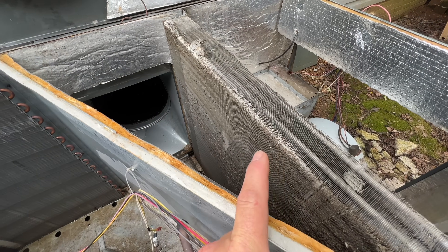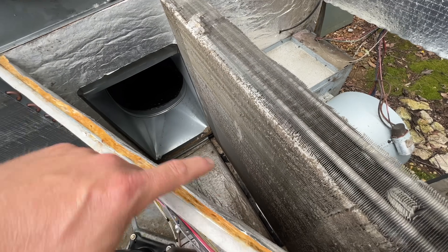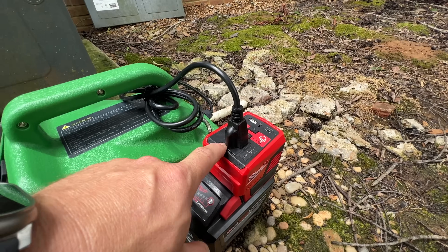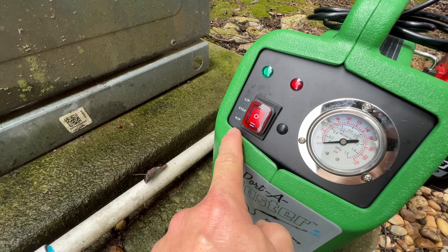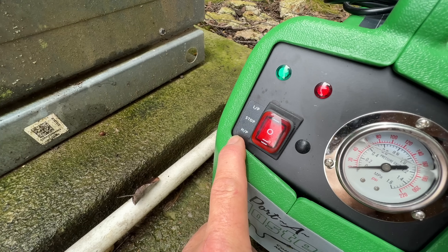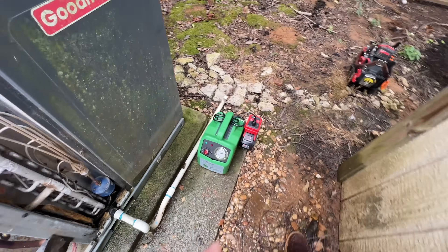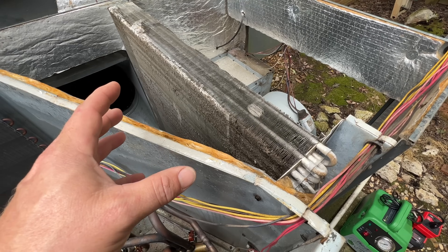When it comes to cleaning the indoor coils, I don't like to use the garden hose because it has too much water and you just can't control the flow — it'll saturate everything. That's where I like to use this portal blaster, made by Sepco. I have it set up with a Milwaukee power inverter so I don't have to run an extension cord. It has two settings: high pressure and low pressure. The low pressure is what we'll use for the indoor coil, and if you don't have water access for the outdoor coil you can use it on high pressure with just a five-gallon bucket.